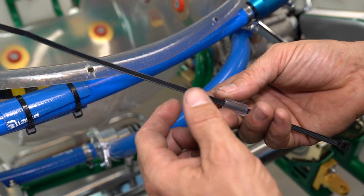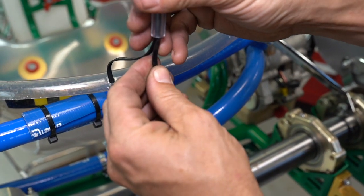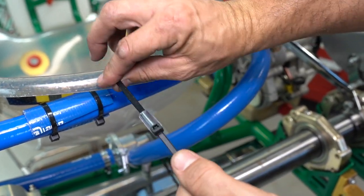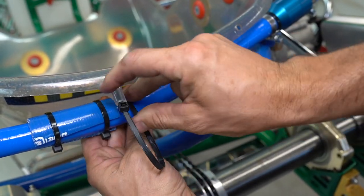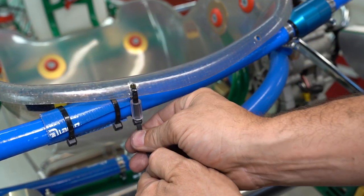The last little trick is to get a small piece of fuel line, feed it down through here with the zip tie and back through — we've done this on the fuel line filters before. That gives you a little standoff off the back of the seat. Run that around your water hose and back through the zip tie, and you've got yourself a little standoff.